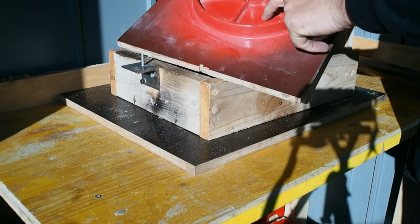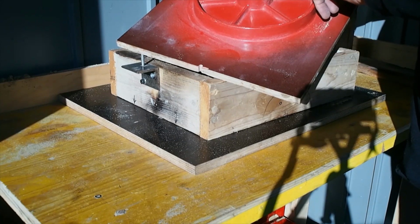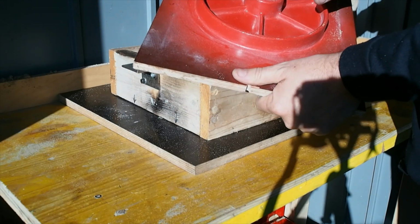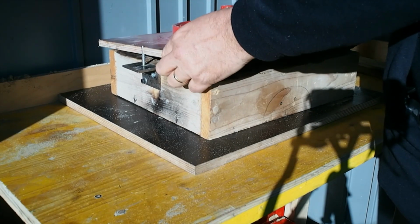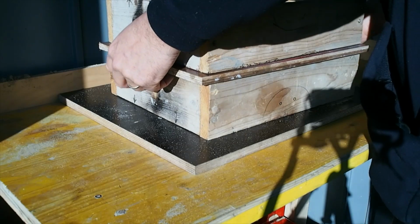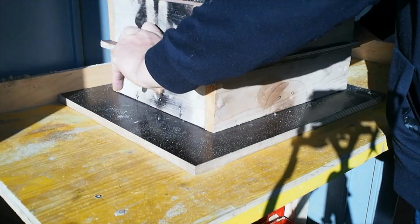The pattern itself was 3D printed in 3 parts. It's about 210 millimeters across, and I use a baked sand core for the hole in the middle. So it just goes on the pattern like this, with the flask like this. Flask lines both sides. You ram one side, flip it, ram the other, cut some gates.